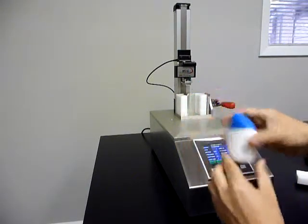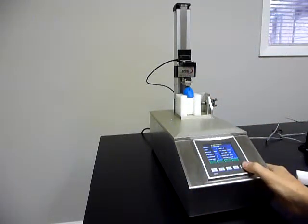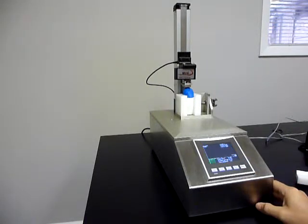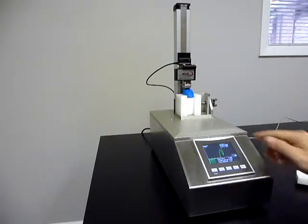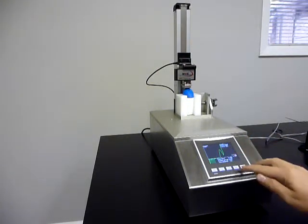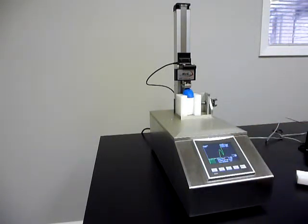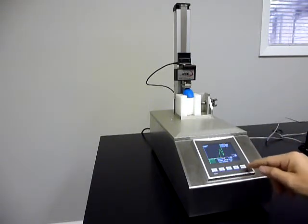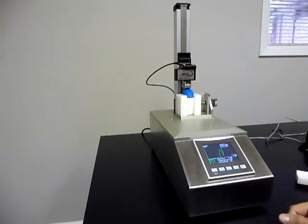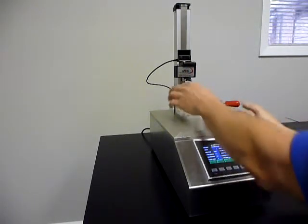So I'm supplying a cap, an open cap, clamp it, and press the start button. And this determines the peak force. It will read out on the top of the screen that local peak, but it also goes up, and just to double check that was a peak and to display it on the display, it also goes up to a predetermined or pre-programmed set point, which is 15 pound force. So that's about the closing force.